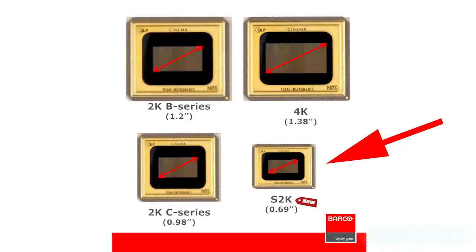There's also the introduction of the smaller DLP chip from Texas Instruments — the .69 — and the smaller chip allows for a lot of cost savings, because we're getting into a more domestic sort of size and commodity type parts could possibly be used in the manufacture of the prisms, the light source, the light engine, and the light path. The lenses — the apertures are smaller and it's easier to make the glass at the smaller lens sizes, giving a great reduction in price there — not quality. I'm sure the quality's just as good as the bigger projectors; it's just easier to achieve at that small size.